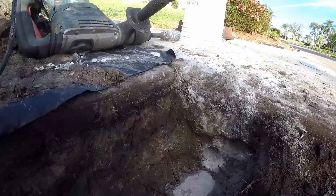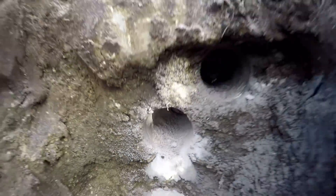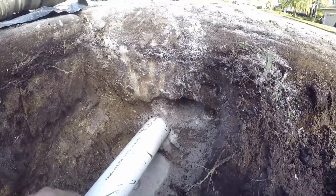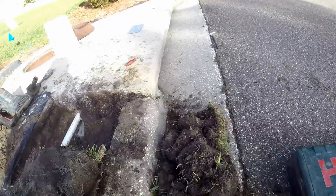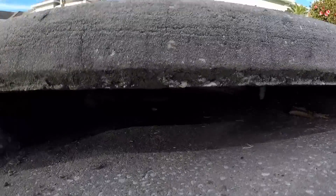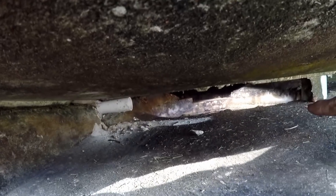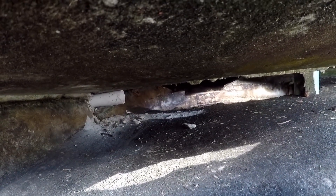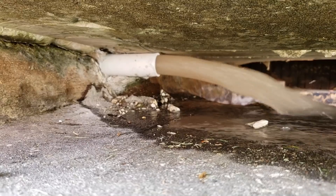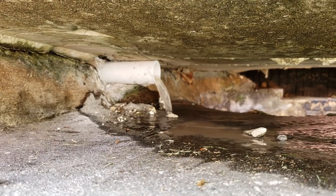So I went ahead and re-drilled another hole, because the first hole was a little too high. And you can see, if you look through there, we go right through into the storm drain. Let's go ahead and slide a piece of pipe in so you can see — it goes right into the storm drain. Real nice, nice tight fit. No water leaking there at all. Let's look underneath here so you can see it. Remember, this is a curb drain — a storm drain has a curve. You can see our pipe over there, it comes through, and the actual drop of the storm drain is back there. Water's going to shoot across here and just run right back down into the basin, where it's going to be taken across the street to another 18-inch pipe. That's coming from the sump basin — it lifts it up and sends it all the way back over here to the storm drain.